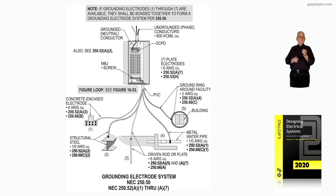If we had a 600 KCMIL terminating to that main in the panelboard, and those conductors do not have an overcurrent device ahead of them, we would go to Table 250.102C1 to size the grounding conductor — but we'd also go to Table 250.66. Based upon 600 KCMIL, that'd be a one-aught. NEC 250.52A2 deals with the structural steel, and 10 feet or more of it in the earth qualifies it as an electrode. It could be in compact dirt or with concrete around it.